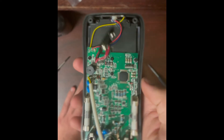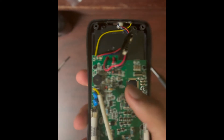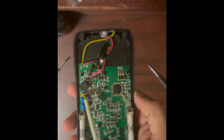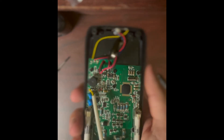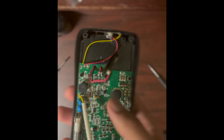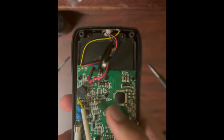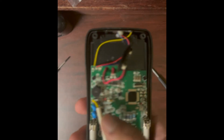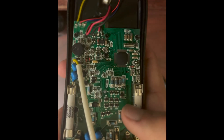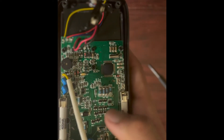My old manual-ranging meter makes the resistor divider much more distinct and easy to see. On an auto-ranging multimeter it's different because the meter has to switch between ranges itself, so there are small MOSFETs or transistors that turn individual resistors in the divider on and off to change the range.